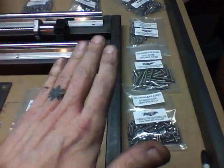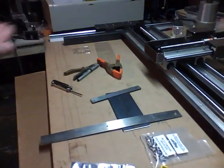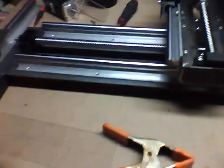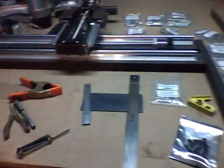Winding sticks have been used forever in carpentry, and I personally have used them a lot. It worked phenomenally well for setting this up — I set a winding stick on one upright and on the other upright, got it all clamped down, and was able to sight across and be sure they were both in plane. I repeated that test with sticks going along, and that told me the two pieces of material were flush with each other and that there weren't any whoopde-doos along the length. Lo and behold, thinking like a cabinet maker, I can stick metal together straight.